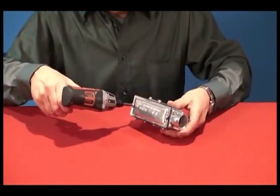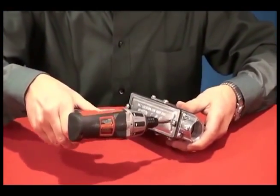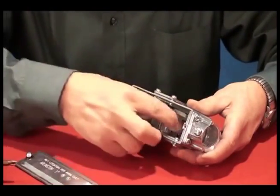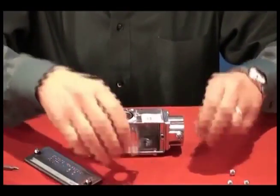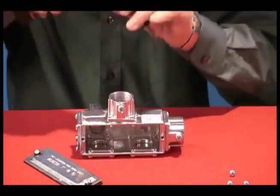Converting them is easy. Simply switch the blank plates and threaded flanges to create the style you need. Here's how. Remove the gasketed cover and the threaded flange inside the body. Remove the cover plate, then reinstall the supplied flange in the appropriate opening for the style you want — in this case, a T.